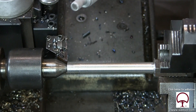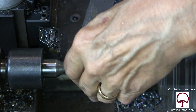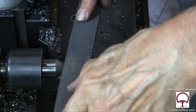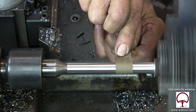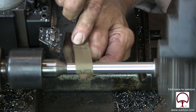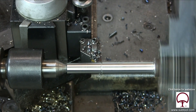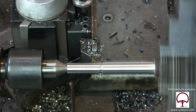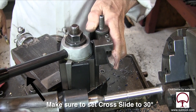We're going to be chasing a thread. I'm checking it here to see if it's nice and straight, and it is. Here I'm filing — it looks like my hands are a lot closer to the chuck than they really are, but that's just the angle of the shot. There's no need to really polish this, but it makes me feel good when I do. I'm going to put a little undercut right here for clearance for the tool bit after we chase the thread.